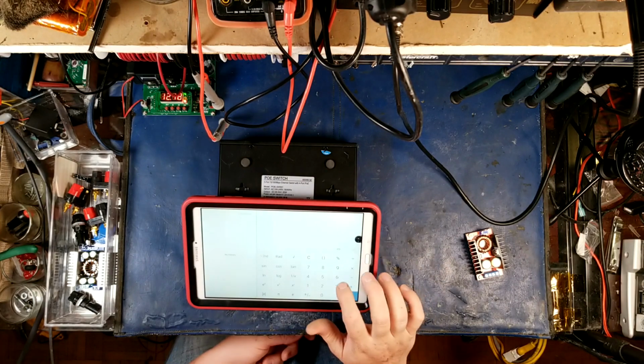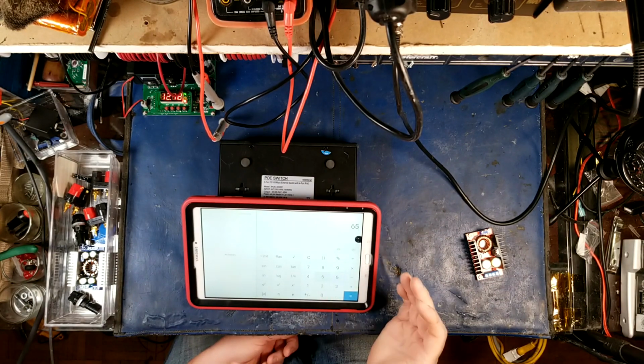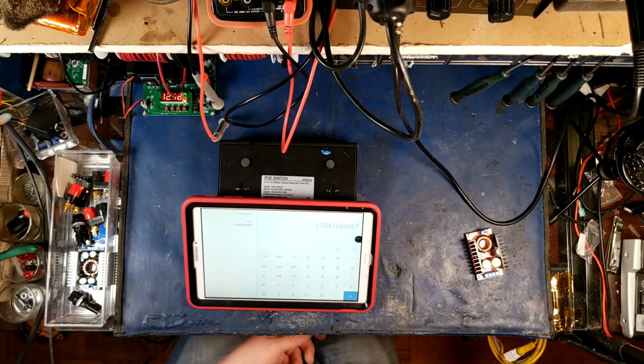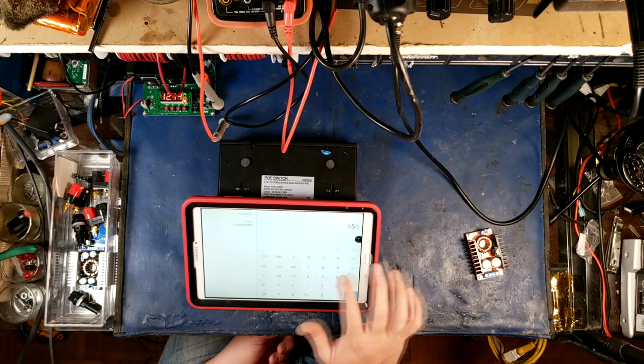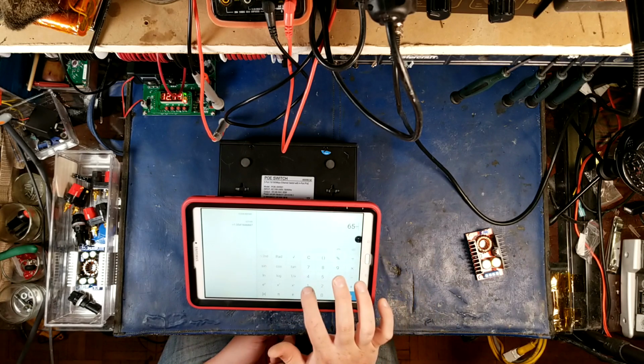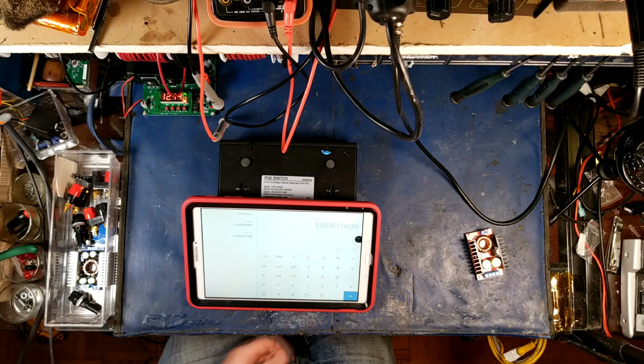So anyway, 65 watts. 65 watts divided by 48 volts, because that's the lowest voltage, is 1.3 amps. Yay. But that's not what's going to be coming into this. The lowest voltage that's going to enter this unit is going to be 12 volts DC, more than likely. So let's take 65 watts and divide it by 12 volts. In fact, 65 divided by 11.2. So this thing can pull a whole whopping 5.8 amps at its worst when it's trying to upconvert.